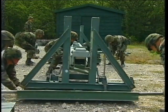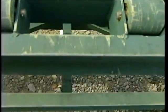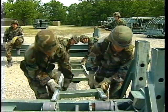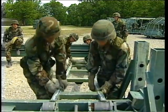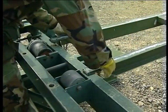Place a roller beam assembly 0.5 meters in front of the F-prime peg. Connect two longitudinal girders to the front roller beam. These girders are sometimes known as ladders. Secure them with dowels.